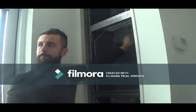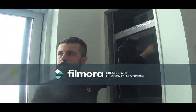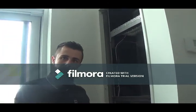Okay, now the other section here, let's get to this. So here's your fan coil filter. So fan coil and everything, heating and cooling at the bottom. On the top you have the ERV. Correct. Now the filter, we recommend semi-annually changing the filter, so basically at your changeover seasons. If you're doing any construction or anything like this, I would change this filter now, just because it'll pick up the debris a lot quicker.